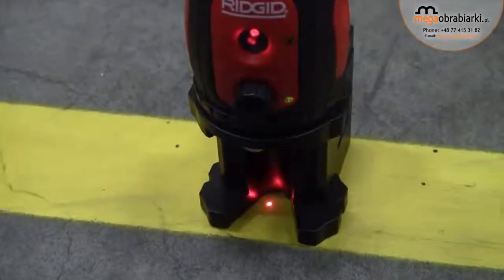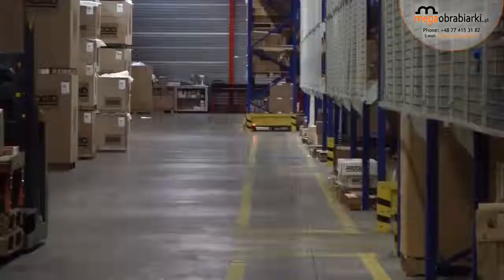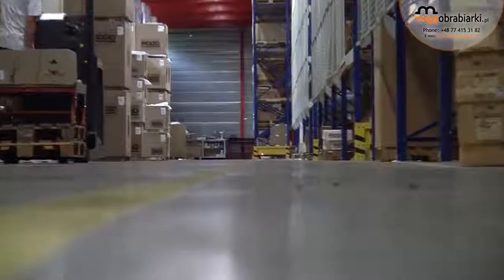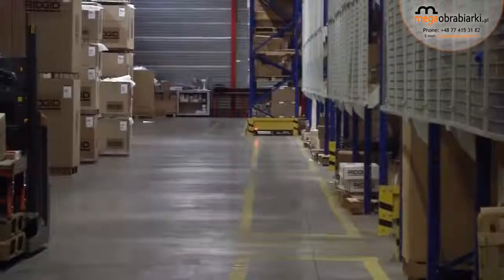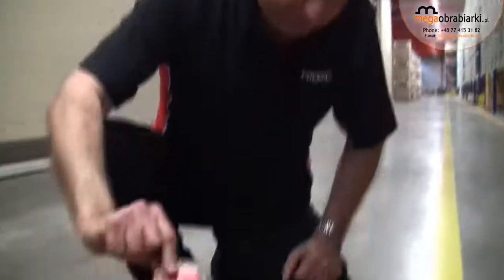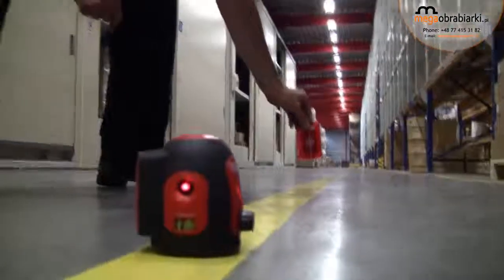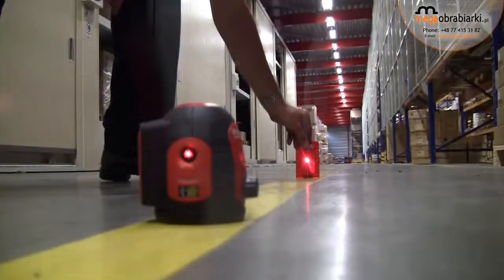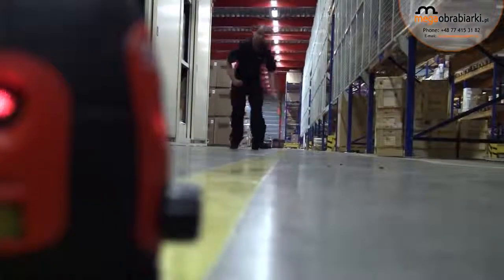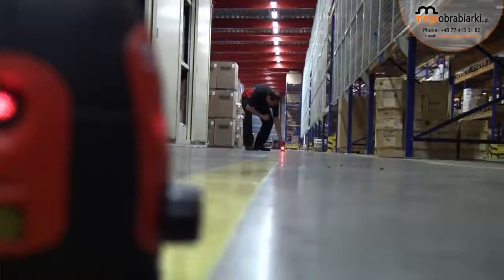What we've simply done here, we've come through to the warehouse and we've set this thing up and we're projecting right the way down the warehouse here off our racking system, as if we were going to lay out some new racking — put a second rack along here in line with what we've got existing. So take the target plate that comes with it, and every time you want a fixing point for a new set of legs, drop the target plate down and there you go — put your fixings in. A nice easy application for the DL500, and those lines will be spot on all the way down the warehouse floor.